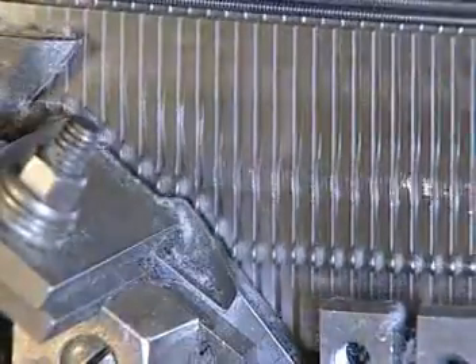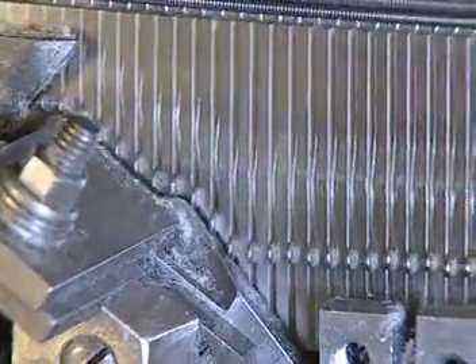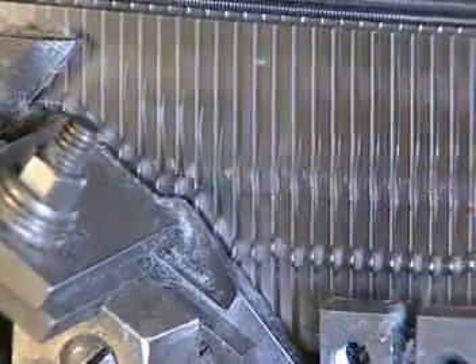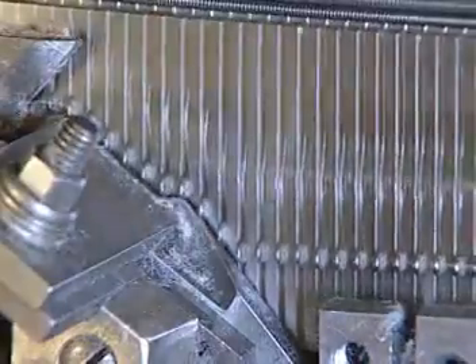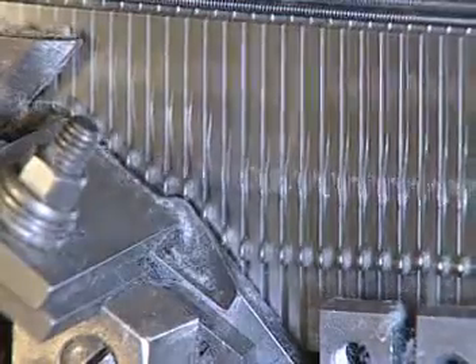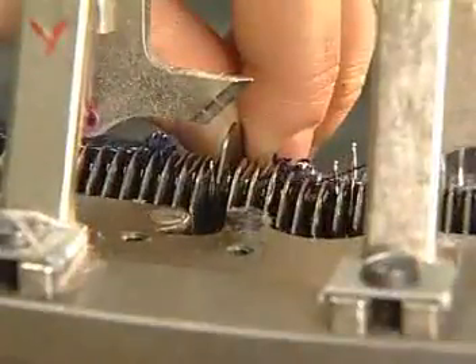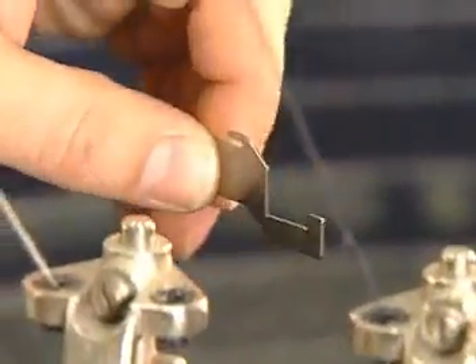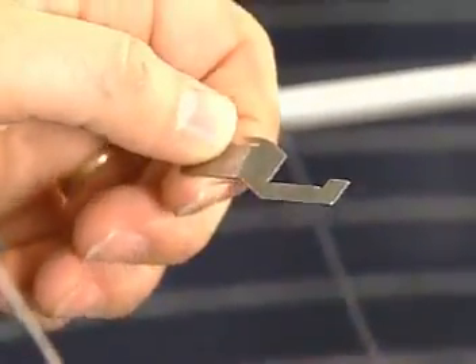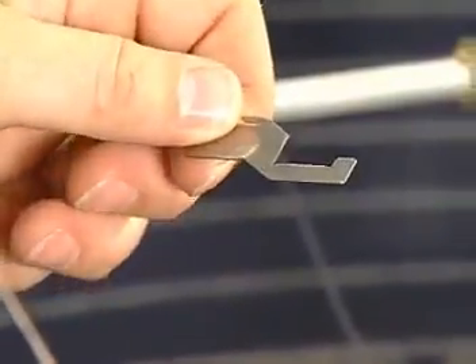Take a look at this same action while the machine works. Watch how needles run through the cam ways, which cause the needles to rise and fall. Remember that this machine has a cylinder that contains vertical grooves and slots to hold the needles that move. As needle activation occurs, how does the machine control the movement of fabric as it knits? There's one more part, placed between each pair of needles, that you need to see to better understand this. It's called a sinker, and here's what it looks like.